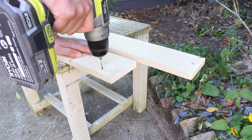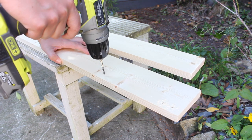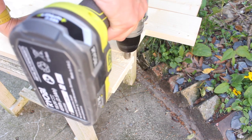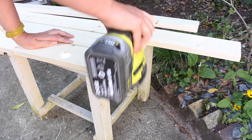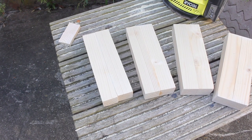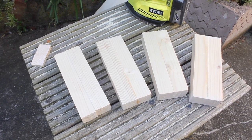Starting with the two long 121 centimeter pieces, you're going to drill some holes — two on the bottom right and left, and then a hole every 10 centimeters. These holes you're going to countersink as well. Give all your planks a nice sand so the edges are nice and smooth. Moving on to the legs: you're going to glue two pieces together, so instead of eight 18-centimeter pieces you're going to end up with four pieces — these are the four legs.